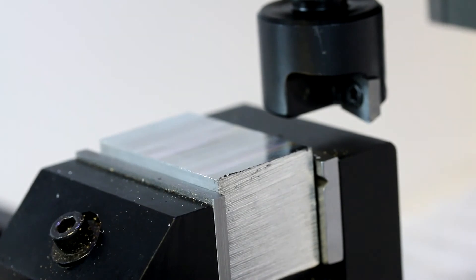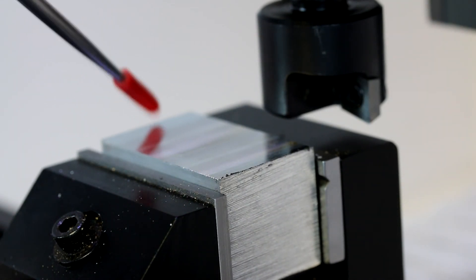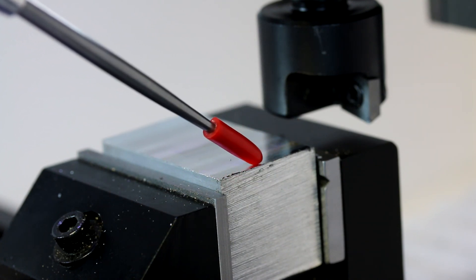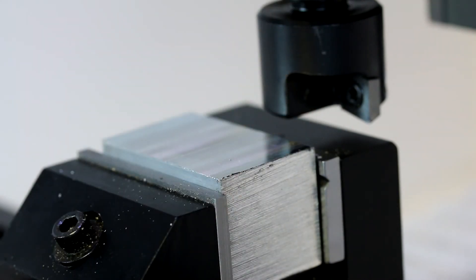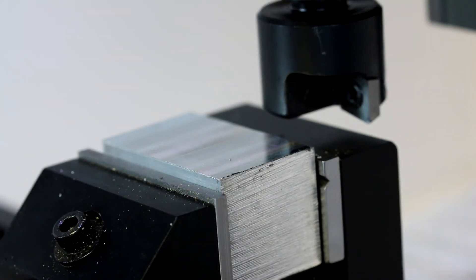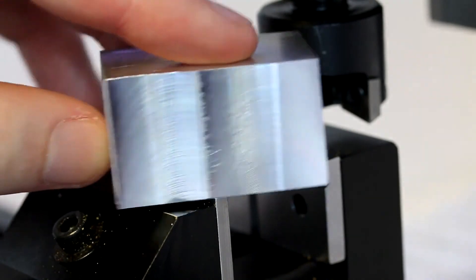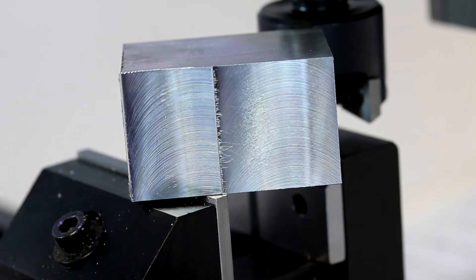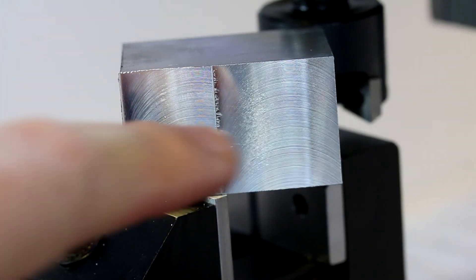If we were to do cuts where we're cutting halfway through the piece with the fly cutter and doing a second pass, we'd find a line down the middle because our front to back tilt on the head is also still off. So these are some of the problems and frustrations you might see on your work pieces. I just wanted to show this so that if you get this type of behavior in a work piece, you know your alignment is off.